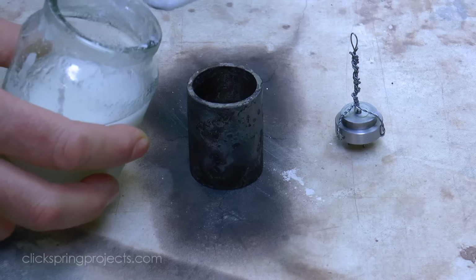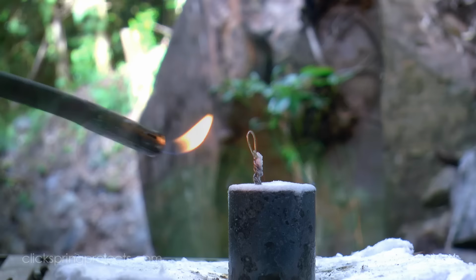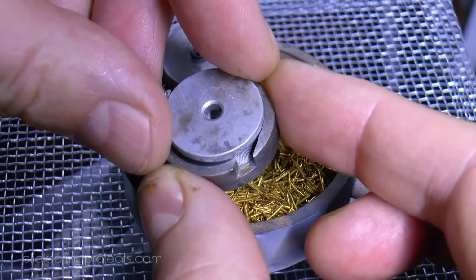By far the most effective substance I've found for minimising heat treating scale is powdered boric acid, mixed with denatured alcohol. When generously applied, it completely envelopes the workpiece in a molten glaze, essentially solving the issue entirely. In this case, I'm quenching in water, so the glaze mostly fractures off. If quenching in oil, the glaze can be removed by briefly soaking in hot water.